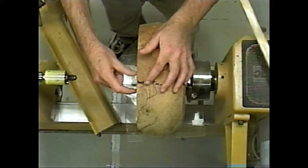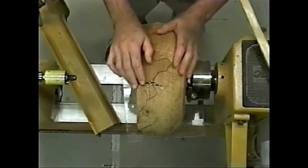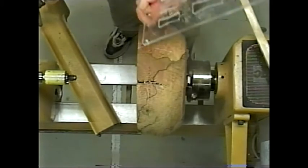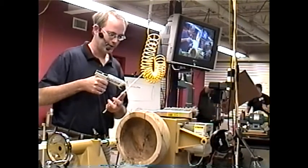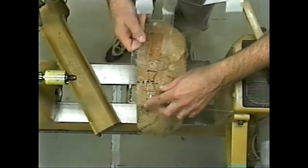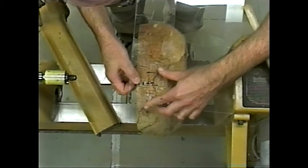You don't want your bow tie going all the way through, so just round it out. You can sand it if you want, but you want to be within probably an eighth of an inch of your final dimension. Take this template — it's a big one — put the glue on it, I put quite a bit on there. There's no other way I know of to clamp this on — I tried every way I could figure out. Put it on there and just hold it until it sets up, making sure it's really secure.